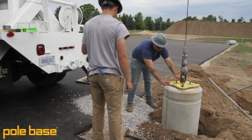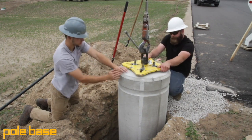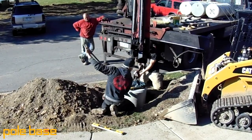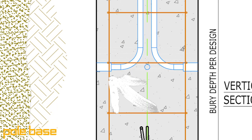The next step is to backfill the unit. Generally, we suggest using crushed stone for this process, and you fill the hole up to about where the conduit line is on the Pole Base unit. There are couplings to the conduit at the top and below-grade portion of your Pole Base unit. At this point, you can take your conduit from the trenches, make sure everything's primed and glued and your wire is ready to go, and run both your wire and conduit into the Pole Base unit so that when this thing is over, you can actually mount the pole and pull your wire right up and get everything lit.